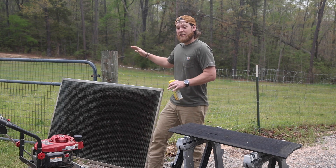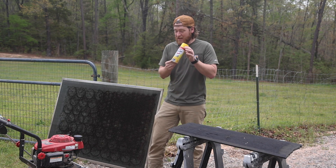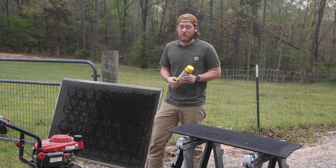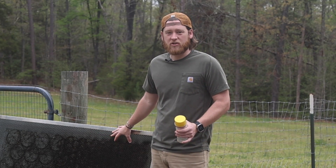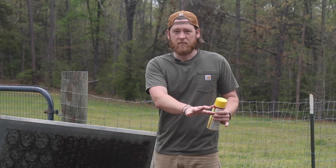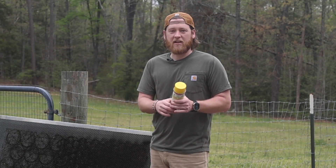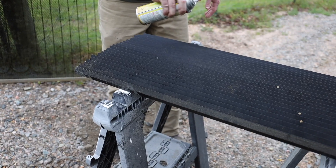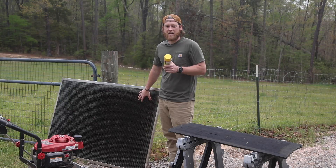Now we are going to clean the honeycomb and the rails of the laser. We are going to need a heavy duty degreaser like an oven cleaner and a pressure washer with a wide angle nozzle. We have taken the bed and the rails outside. Lean it up against a fence or put it on boards or some saw horses. Take your degreaser and liberally spray the entire bed and rails, then let that sit for 30 to 40 minutes to really soak in and eat away at that soot.